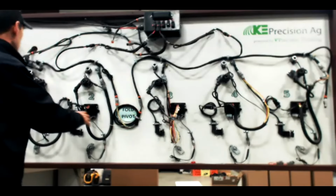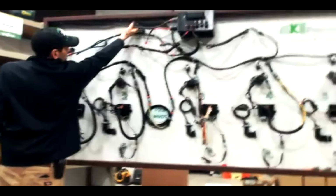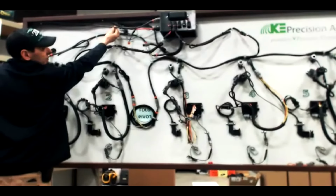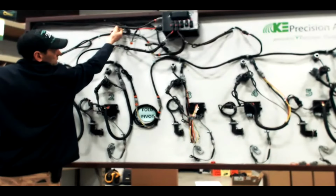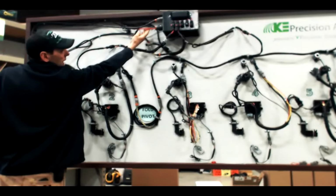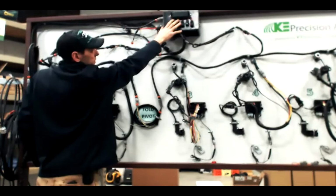harnessing infrastructure. It might be a little bit hard to see in the video, but over here we have our power source. This would be the harnessing coming from the tractor. The big wire up here is power, and the little wire here is CAN or communication. They are independent of each other. In years past, they used to be in the same cable, but they have now broken that out because the big, powerful power wires were abusive to the small little CAN wires, and so they run those separately now, independent of each other, back to your PDM.